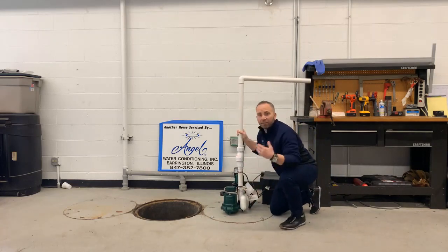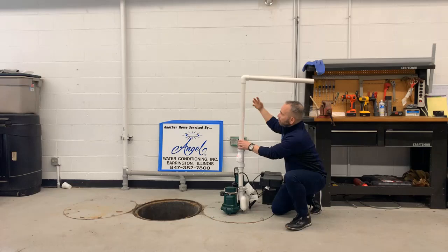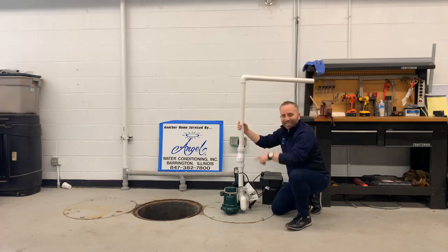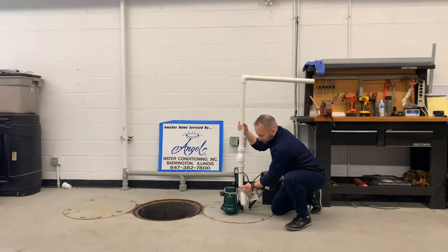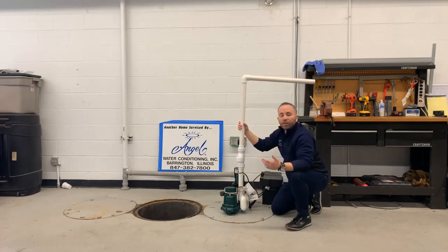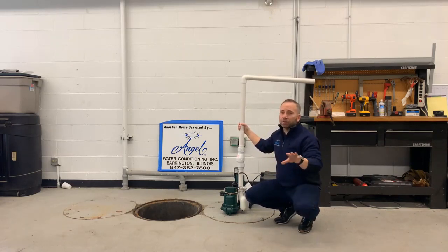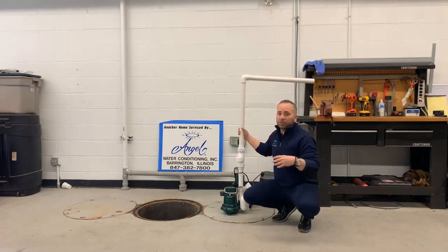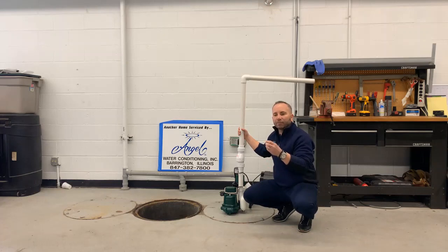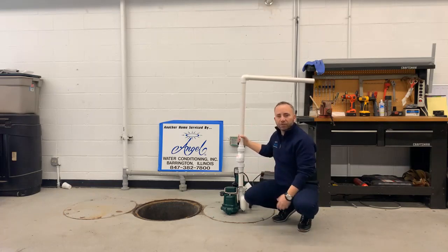In the Chicagoland area we have a lot of clay in the ground, so what pushes against the wall is water mixed with clay. That clay gets into the sump pump pit and gums up the switch. Some people want a pressure switch, but pressure switches fail far more than the standard float switch. Our guys are taught to test your sump pump — as simple as unplugging and plugging it back in and dumping water into the pit to see if it turns on.